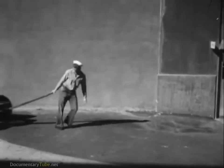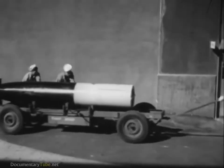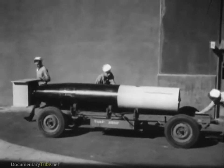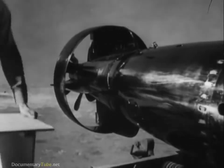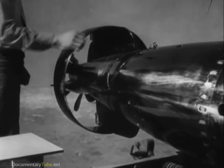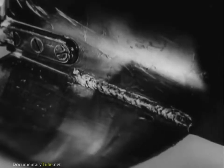All torpedoes of the Mark 13 Mod 6, 7, 8, and 9 type look pretty much like the older models. So what has revolutionized the performance of the torpedo? The shroud ring, commonly called the ring tail, Mark 1 Model 0, in conjunction with a drag ring on the nose of the torpedo, does the trick. This is a steel ring welded to guide vanes of the new torpedo.